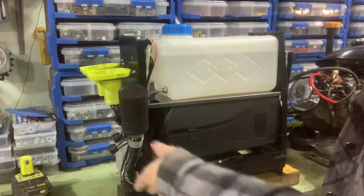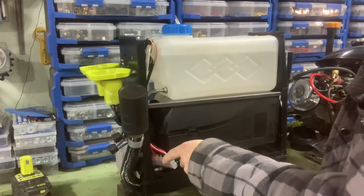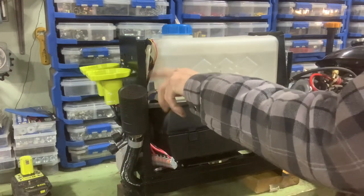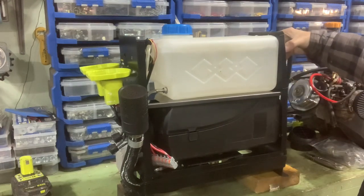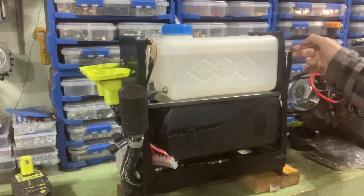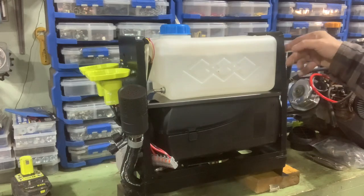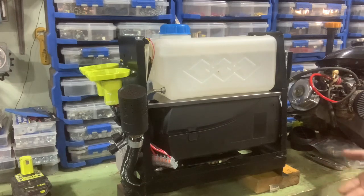That's about it. Clean up the wiring, put that wire sheathing on that I have, clean up, solder everything, heat shrink. Put some edging around here. I might clean up some of that. There's some screws that protrude here, holding on the control panel mount on the front for this thing. The mount is just two screws that are screwed into the sheet metal. And though they don't rub the tank, they come awfully close to it. So I'm going to do something with those, cap them off or grind them smoothish, something. But other than that, there's not much.